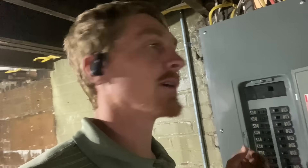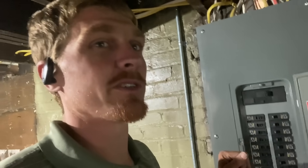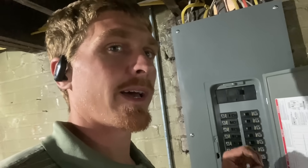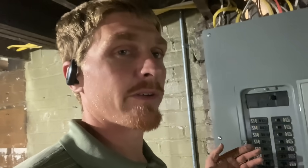One of the things I was sweating most was how many receptacles I could put on 15-amp circuits and how many circuits I needed in my kitchen. There was one small thing I needed to change to pass: in my kitchen I had the refrigerator on a dedicated circuit, and then one 20-amp circuit for all of the countertop receptacles. The inspector wanted to see two circuits on the small appliances and countertop receptacles. He basically asked me to tie one of the countertop receptacles into the refrigerator circuit so that I had two 20-amp circuits feeding the countertop receptacles.